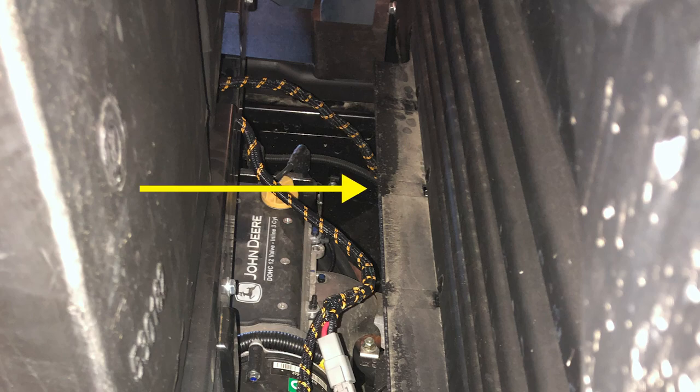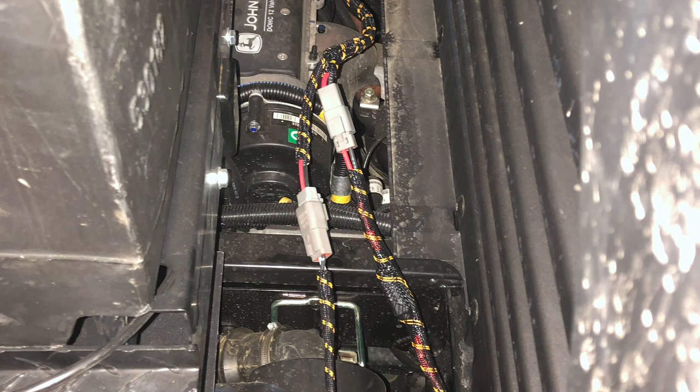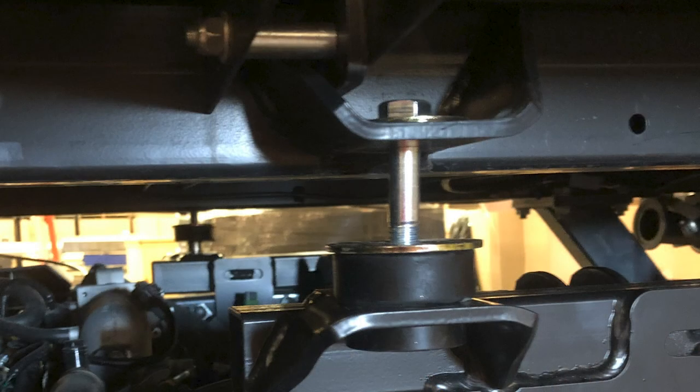It's a keyed connector and it's got a nut to lock it in. While you're in there, come over to the right side of the gator and connect the main tank and frame harness to the battery harness that you installed previously. At that point, you're free to continue lining up the tank and frame with the gator brackets.